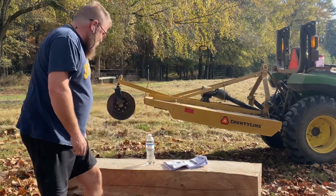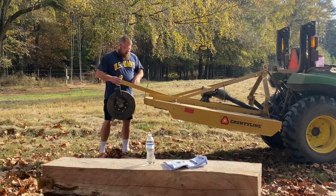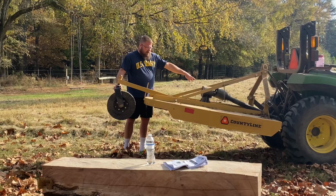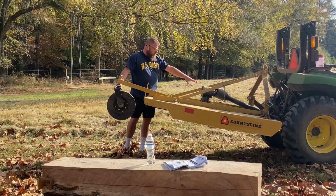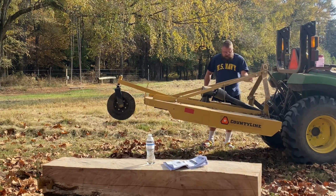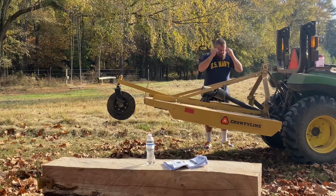Let me go over here by the tractor, and I'm gonna just point the pins out real fast. Don't be too close. When you get it from the manufacturer, delivered or bought at the store, these components are going to be folded up. The wheel will be off, and it'll be on a stanchion hooked to the bottom. The PTO shaft will be off. This bracket, this assembly here, will be off, and it'll actually be flat to the deck. So basically all these components you've got to just loosen up. This one you actually got to take off, but adjust to get staged in this position.